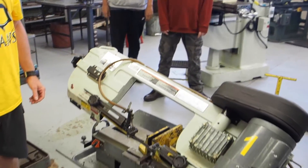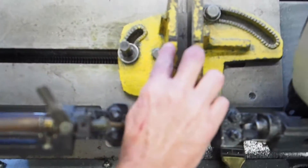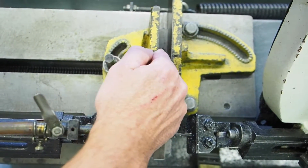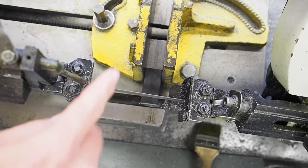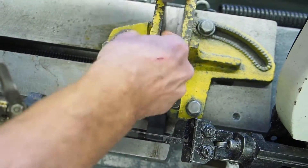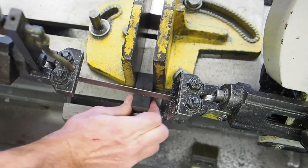Rule number eight, the last rule: when sawing small pieces, put a piece of equal size at the opposite end of the vise to prevent twisting. If you look at the vise, I've drawn a black line on here — this line might not be here the year that you're here, so use it as a good rule of thumb. If your piece is smaller than halfway on the vise, for example if you've got a piece and you're trying to cut a small piece like this and it's smaller than where this black line is, you need to put a piece of equal size in the opposite end of the vise. That gives it something to hold on to on the back, and now the front is nice and tight.